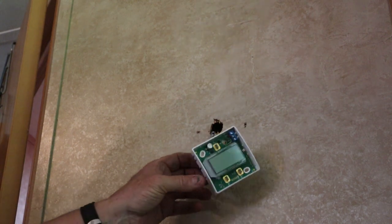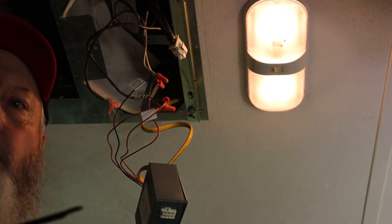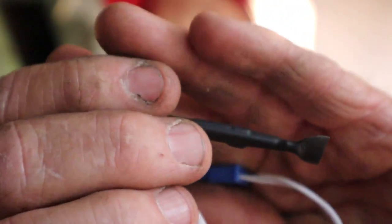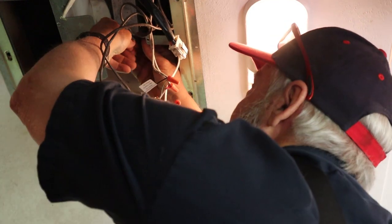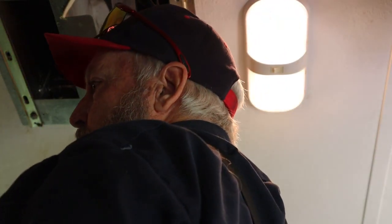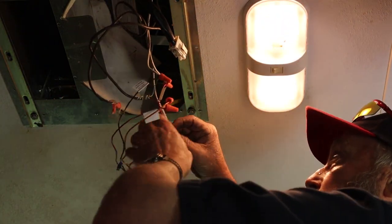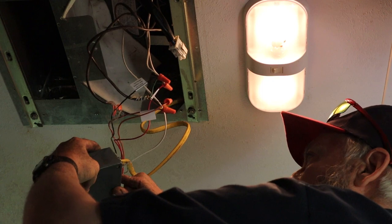I'm going to go plug in the control box. We should get a display light. The only thing we've got left over here to do is put our freeze sensor in there. Just this little end right here goes inside the coils up here - it's mostly done by feel. Just stick that in between two fins, point it down at about a 45-degree angle, and shove it in there. Then it plugs into our control box. It's the only little two-pin connector on there.